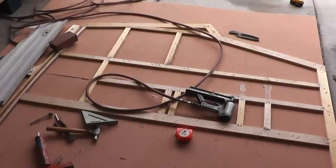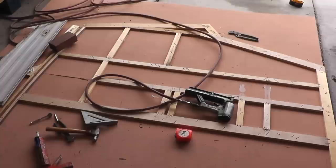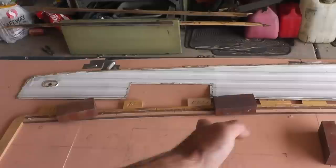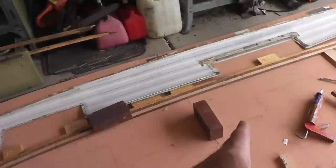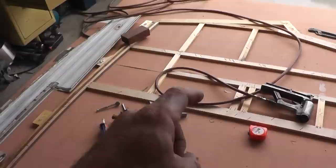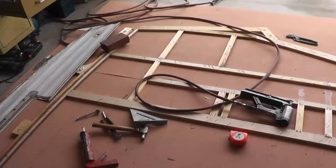I'm taking my time working in baby steps, but I am slowly framing out this wall using both new lumber and some of the original wood that's still in good condition. The design is similar but not identical to the factory wall — mainly I've changed the positioning of the plywood panels in relation to the framing. In the original design, the first piece of plywood started at the back of the trailer and terminated at four feet in, then the next piece started there and stopped at the door frame, with a single small piece above the door frame, and a third piece going from the door frame to the front of the trailer. This was good for minimizing materials during manufacturing.